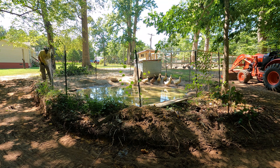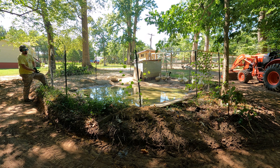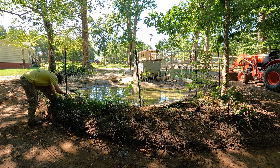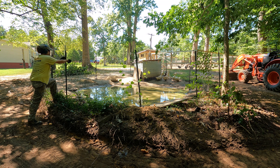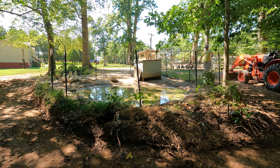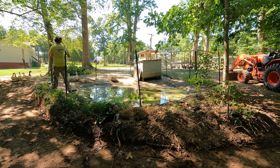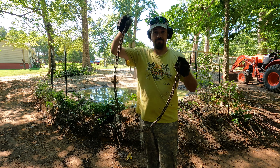We're going to start with just on the backside, pulling some of the stuff out. There's going to be God knows what coming out of there because there's been God knows what coming out of it so far. If you look right here, you can see the ground is pumping some. We're pushing out some of this nasty mud that's in here, which is good. This is what we want — we want to find the soft spots and get those taken care of so that when we put good dirt in here, the water is not undercutting the dam. I still have some work to do up here with the rippers, and then I'm going to switch over to just the straight box blade without the rippers so that we can scrape this out and get down to a good hard pack.